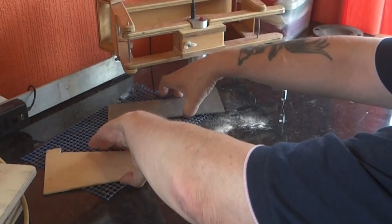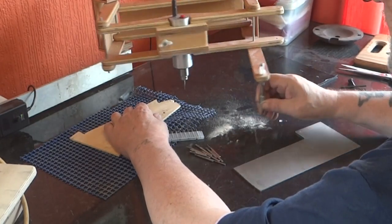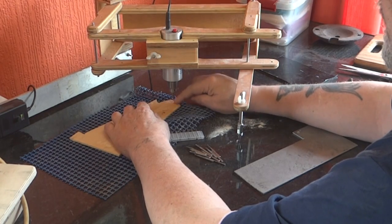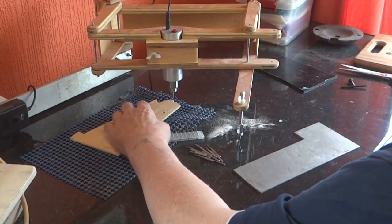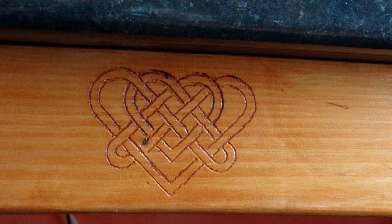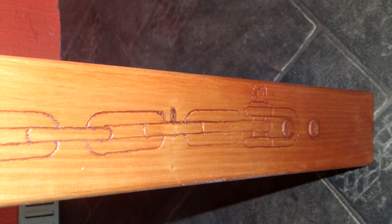I would normally tape stuff down, but if I'm just doing something quick, I put that on there and set the depth so that it's halfway through the anti-slip mat, and you can quite happily cut a piercing cut in 3mm ply with the very finest tool. It's worse than a scroll saw for grabbing — it wants to go with the grain, there's no two ways about it, and you have to make a deliberate effort to force it across the grain.